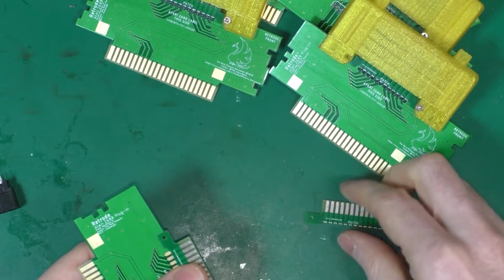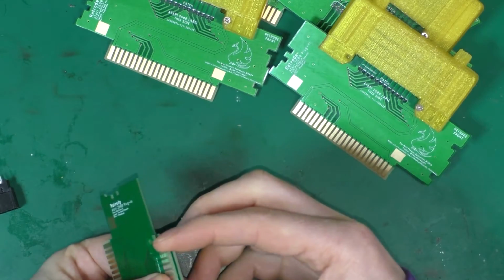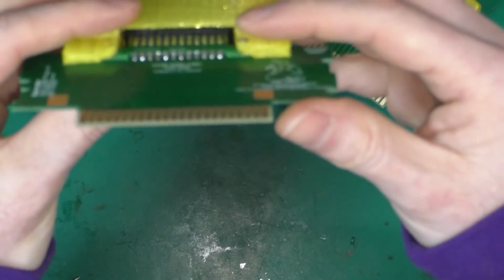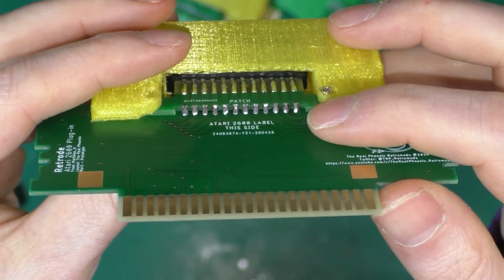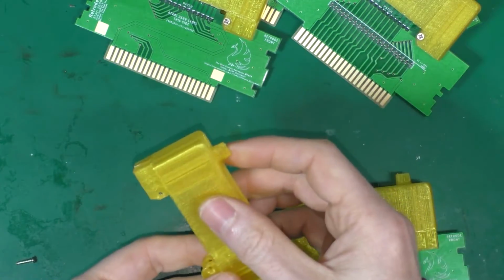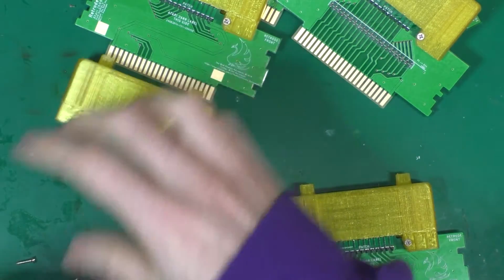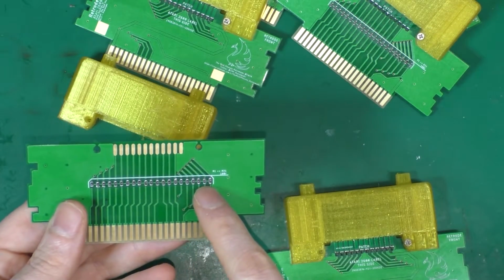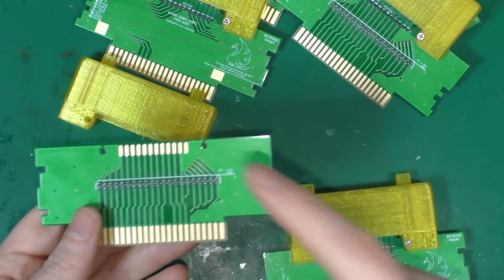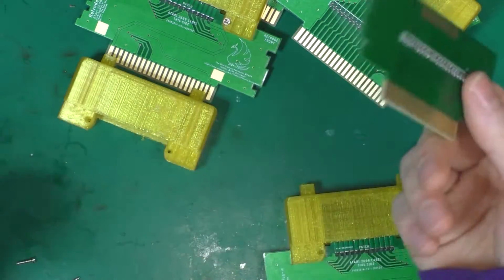I don't think you need an explanation of how to assemble it. It's pretty straightforward. You put the adapters with the screw to hold your solder here. You need to have contact like that. It's really easy. Then you solder your connector. You 3D print this one, again, the STL file is going to be in the description. You put that, you put the screw, and that's it. You will have to put 21 resistors. It's 100 ohms. And maybe you can simplify and use arrays, but it's really easy to put them. So yeah, I don't think it's worth an assembly video.